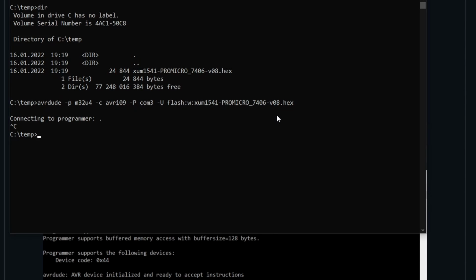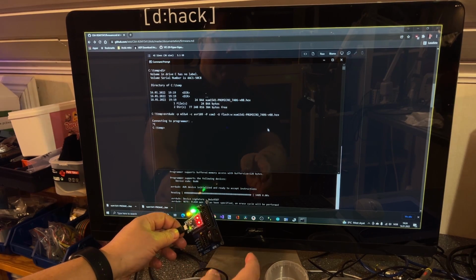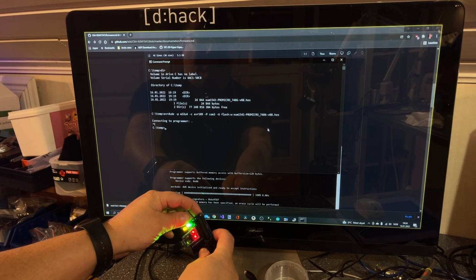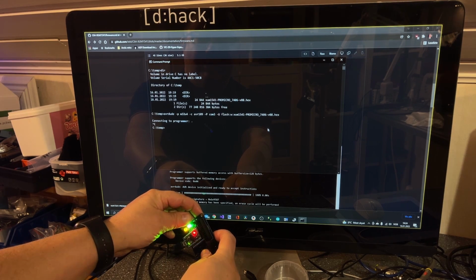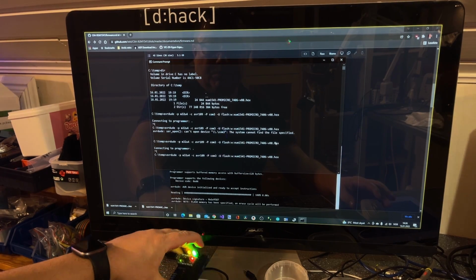Reading a little bit more, you are actually supposed to flash the microcontroller right when it boots up, and the bootloader just takes 0.7 seconds. That's way too short time, but it has a special function that yeah, if you press the reset button twice, then it will run into a bootloader that takes 8 seconds. Still just hanging, not able to communicate. Let me try once more.